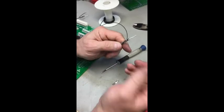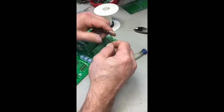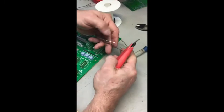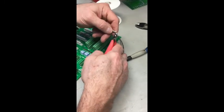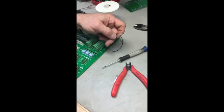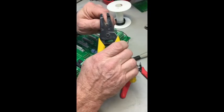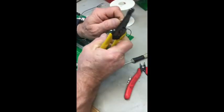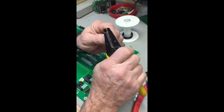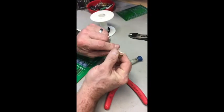Taking your diagonal cutters — without cutting the coax or ground wire — trim off the excess braid. Then pull your ground wire, put a small loop in it, pull it around to the front, and cut it to approximately the same length as the center conductor. To prepare the ends, take your strippers again and strip them back about a quarter inch, exposing the conductor of each.